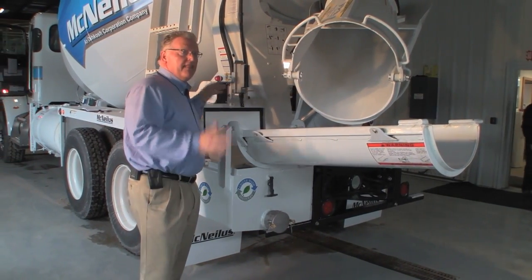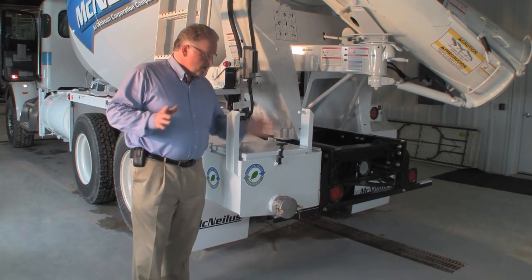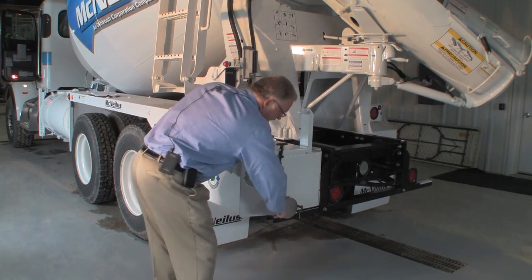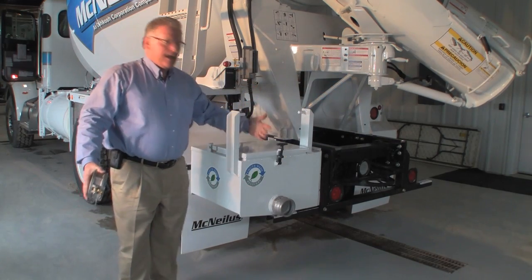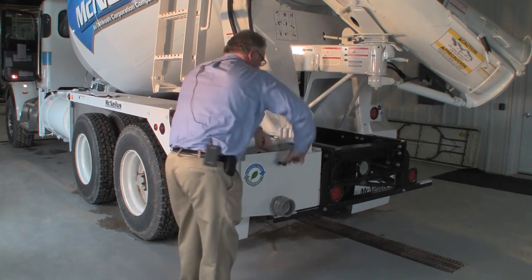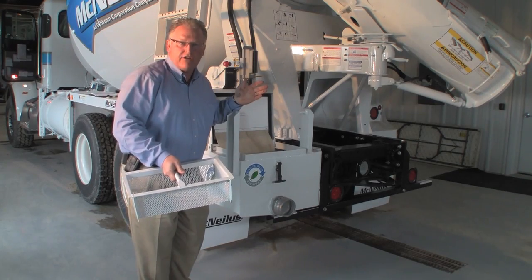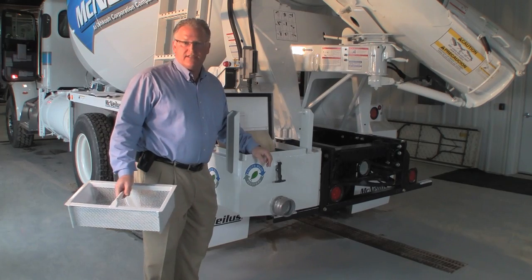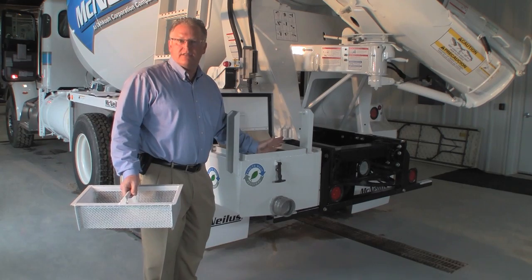Put the box down, and then you're good to go back to the plant. Once back at the plant, back up to your pond system. Pop the cap off the box, and once you're backed up to the pond, it'll drain into the pond. Put the cap aside, then pull out the optional filter basket that strains out your coarse aggregate, dump the coarse aggregate onto the ground, and take your hose and rinse down the inside of the box. It basically takes one to two minutes to rinse out the box at the plant into your pond system.